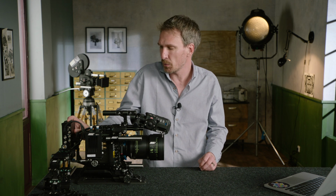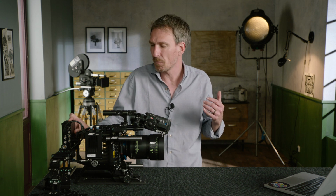Yeah, I think so. I received the question, what is a polyfuse? A polyfuse is a standard self-resettable fuse. If you exceed a certain amount, say your power output on your distribution box is 2 amp, if you go over 2 amp, this would quit and save the entire electronics. And the simple fact of unplugging the faulty accessory would cool it down and put it back to normal. So there's no more fuse to change.